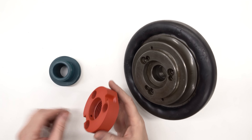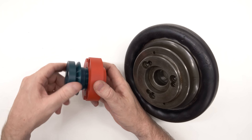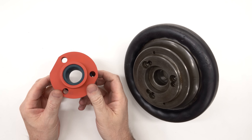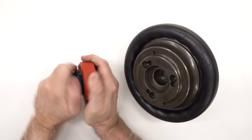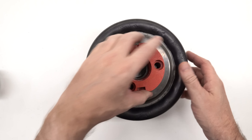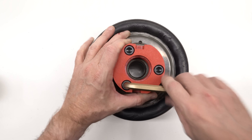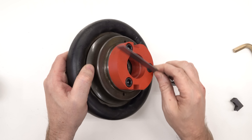From the model I created a set of drawings to make this out of ductile iron, but before doing that I 3D-printed a test model to check fit and make sure I haven't screwed anything up before spending several hours making chips. Here's the test print — printed in matte PLA on the Bambu Lab P1S. We'll try it on the spindle nose first: the thread seems to be the right size, and the register seems to go in, though it's starting to stick a little, which is typical with threaded PLA parts.